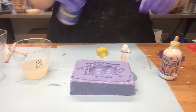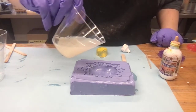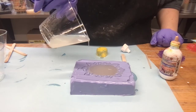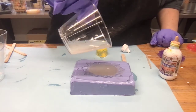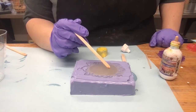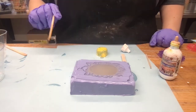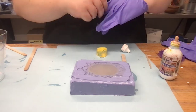Then I'm going to spray release really quickly. Every time you're about to pour a casting, you always want to spray release. We're going to pour high at the lowest point, just like we did last time, and keep pouring the mold material. This mold has a little bit of a tilt to it, so I might have to adjust it as I'm pouring. I put some popsicle sticks below just in case. Now I'm going to take my popsicle stick and try to pop out any of those bubbles. Now we're going to let that sit, and in the next part of the video we'll reveal the casting and I'll show you how to work with pigment.